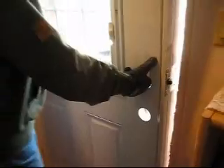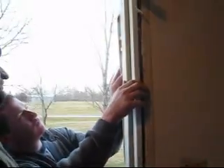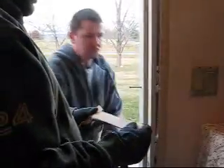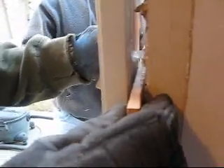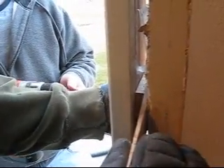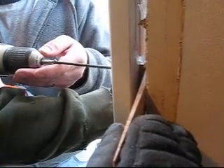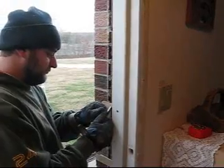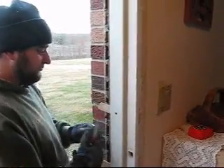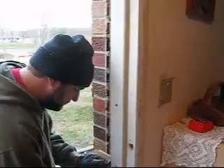Okay. Are we square in the door jamb? In and out. Good. Alright, pull this out. This is one cocked door frame. We're going to make it. Ready? Run it. Gonzo is scoring the shims to break them off. We got the door fairly plumb and fairly level. This opening is not — the opening is cocked really bad. Good job, Gonzo.